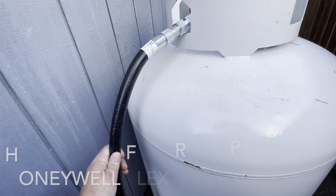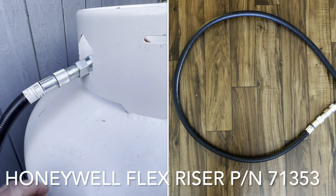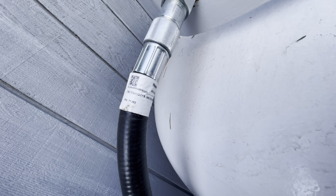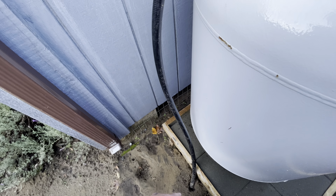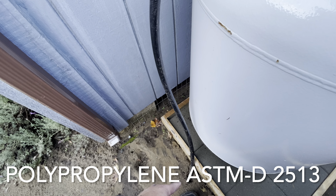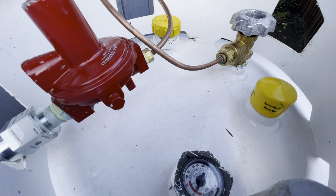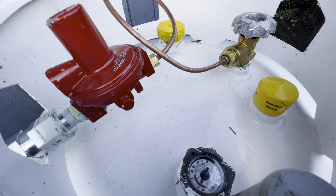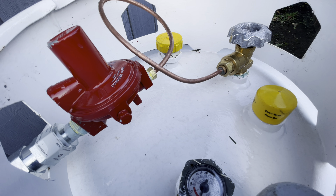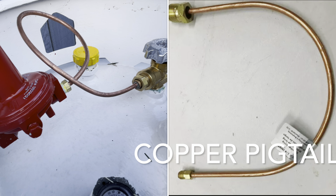This lead here I got at my local propane supply where I got the tank — I got everything I needed there. There's a part number there for you on that lead. This goes down and connects to the three-quarter inch flex — it's a poly gas pipe, yellow. They haven't come out to fill the tank yet — there's only about 20 gallons in this 120-gallon tank. It had the valve on it, and I had to do the copper line there into the initial regulator.